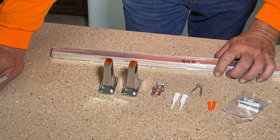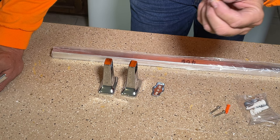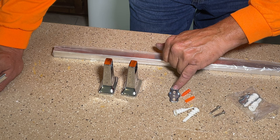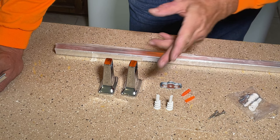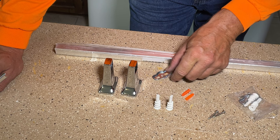The first thing you want to do is just get rid of those anchors. I know they're very convenient, they're easy to install, they're self-tapping and screw right into the drywall, but they'll also eventually come loose and leave a big hole in your wall. Even these little plastic ones are fine for holding something light, but they're junk for holding a towel bar. You're going to use two screws, and depending on which type of anchor you use, they're very close to each other — there's not a lot of drywall to hold on to. Eventually you pull on that towel bar and it's going to come loose, wiggle, and just break through. I don't care what kind of anchors you use, there's just not enough space there to provide a stable base.